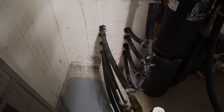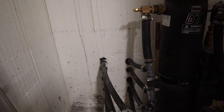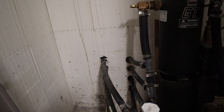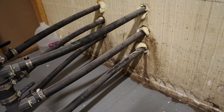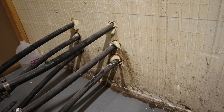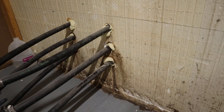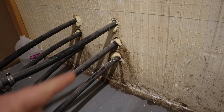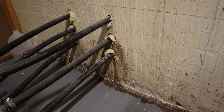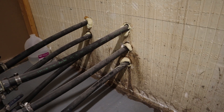Here are my pipes coming through the walls — mine are ICF walls and I have two systems in my house. One I got sealed up perfectly with zero leaks. My other system I did not do such a great job. As you can see on this side there is water drippage coming down — I didn't get it perfectly sealed on the outside. These are actually just stains, not active water, but during heavy rains I do get a little bit of seepage. I tried putting foam in there and that does nothing, so what I really need to do is dig out that ICF and seal from the inside — either with an injectable product or toilet wax.